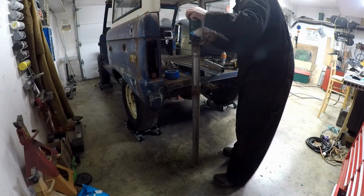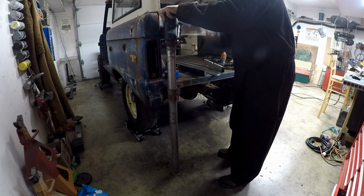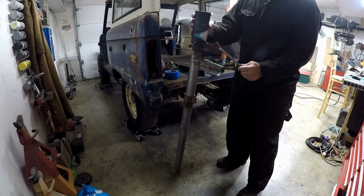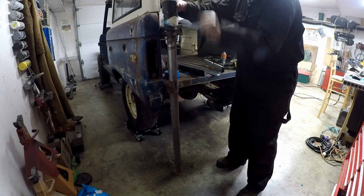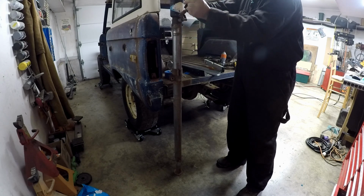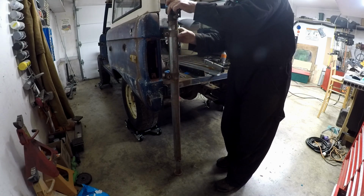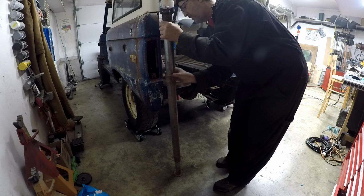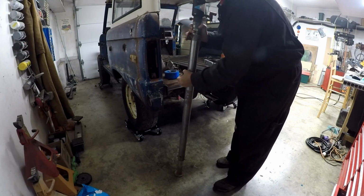All right. So it looks like we're too low for the upper bracket as it sits, so we're going to have to drop our jack handle, then tighten down the bleed screw and then jack them up till they reach. These actually have a lot of throw, about 2 foot, so I'm not really worried that I won't have enough, even if I waste 6 inches trying to get it up to the same level that I need it to be. What's important is that both of these clamps link up with the brackets.